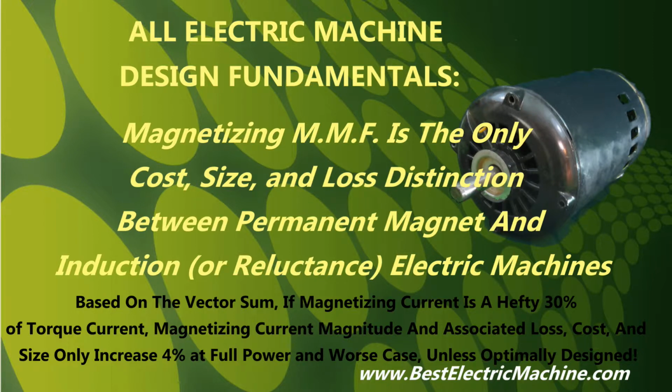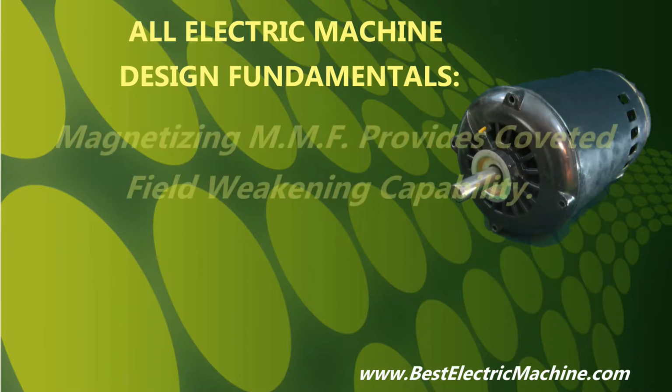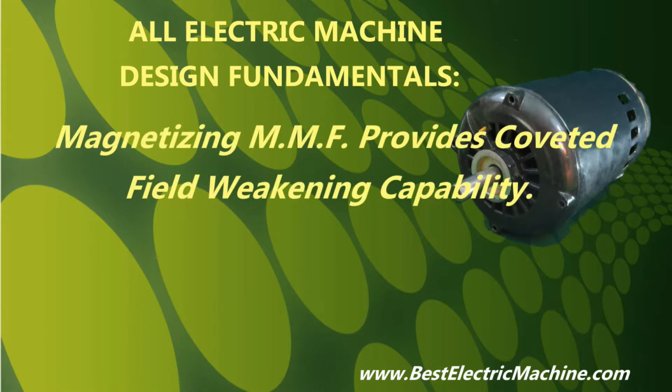Since total MMF magnitude is the vector sum of the magnetizing MMF and torque MMF vectors, magnetizing MMF adds less than 4%, worst case, to the total MMF magnitude at full power, which is well within just the windage and material tolerance range between any electric machine design. Magnetizing MMF provides coveted field weakening capability for higher speed operation, for higher efficiency over broad speed range, and for electronic controller and insulation reliability.